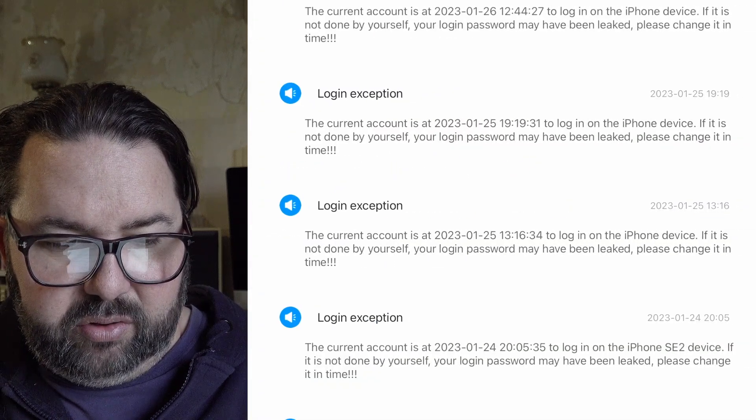In a nutshell: some things are good, some are bad. The good thing is you can open this up on your iPad or phone — Android or iOS — and quickly see what's actually happening: battery state, power coming in, all general things. The bad thing, which a lot of people don't realize, is it's called a data logger and it only logs data every five minutes. If you want real-time information, go to the inverter itself — it tells you exactly how many watts are coming in, how many have been generated, amps, volts, all in real time.